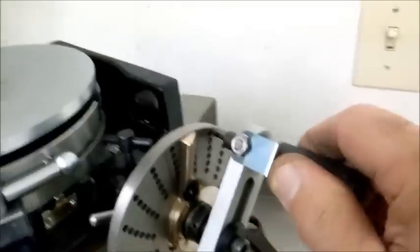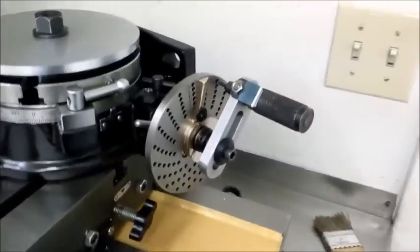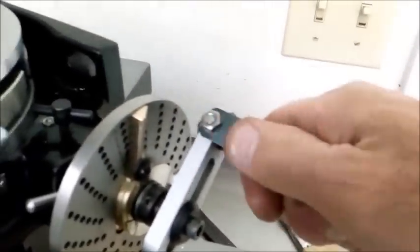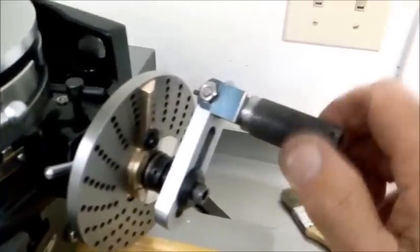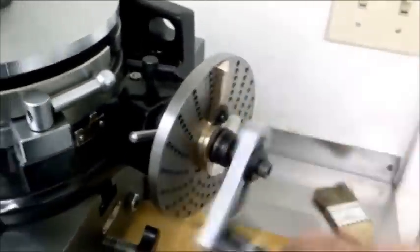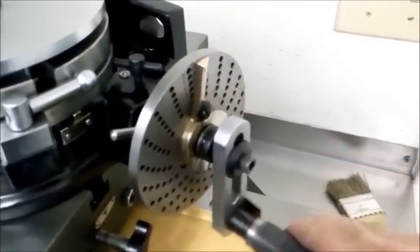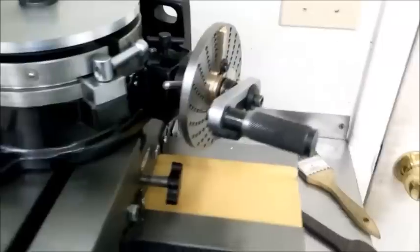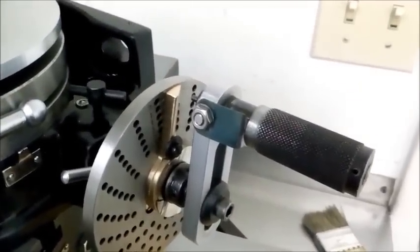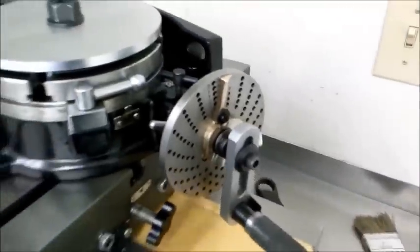One thing I'd like to show — switching out from the hand dials to the rotary plates is really kind of time consuming, and this thing is spring-loaded, so I made this little piece and basically what that does is lock it out. This can still free-spin because it kind of locks it out there. This way I can use it as just a regular hand dial. Having the spring load on it means you're constantly pulling on it and it was really difficult, so I came up with that little thing — I think it's really neat. You can use it so simply now.